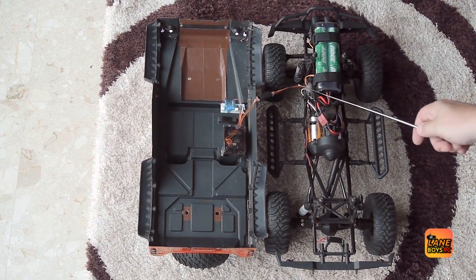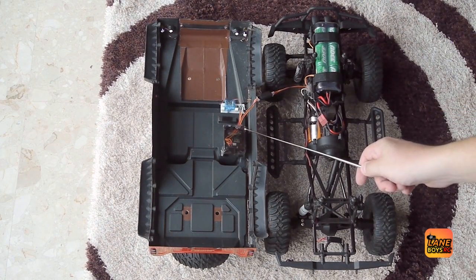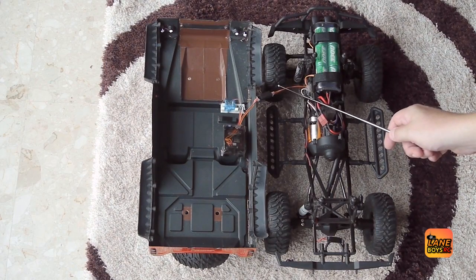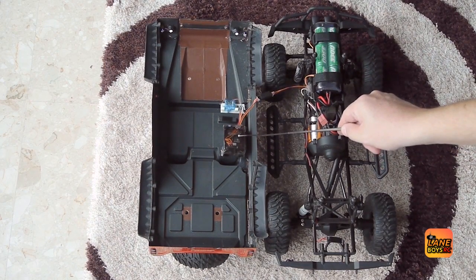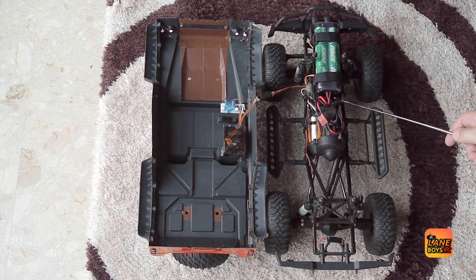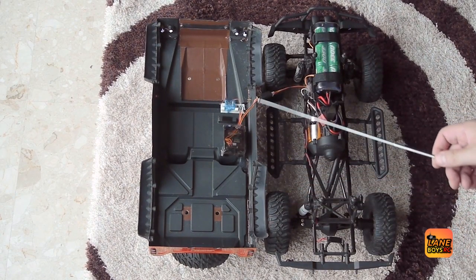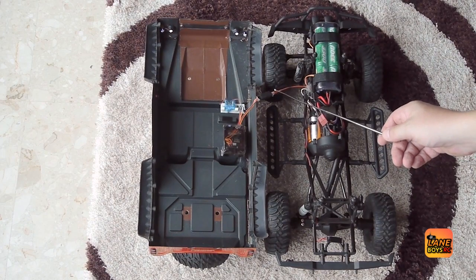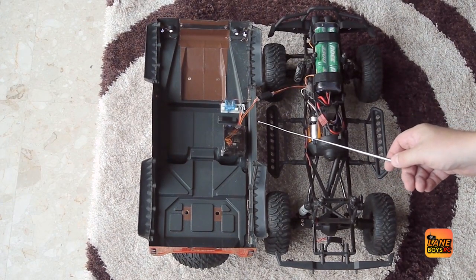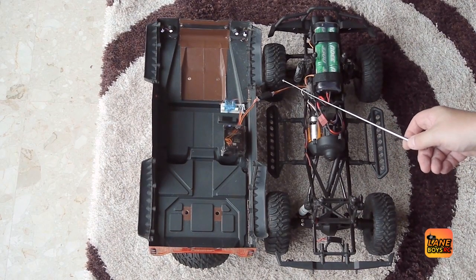There is then a single servo extension cord between the chassis and the body that transfers power and the control signals to a secondary light controller. The secondary controller is actually the same electronics as the main master, however it contains a different firmware. The single cable makes a very neat cabling process, as well as easy to take apart in the field and to maintain it.